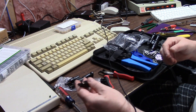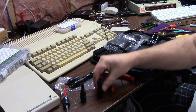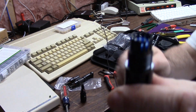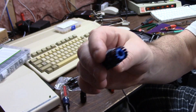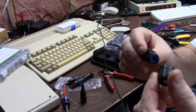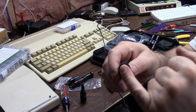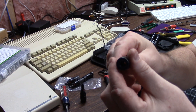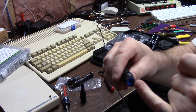When you get a connector, separate it into your positive and your negative, then unscrew this barrel — it'll have a little clicky sound. Do you see these little tabs right here? Well, inside here is a weather-packing silicone bushing that's going to act as a gasket. Your good caps are going to have rubber in the top too, but they also have these little plastic nubs at north, east, south, west on the circle, so when you start clicking it, those will wrap around the cable making a weather-tight seal.